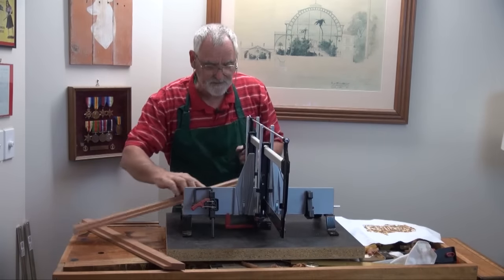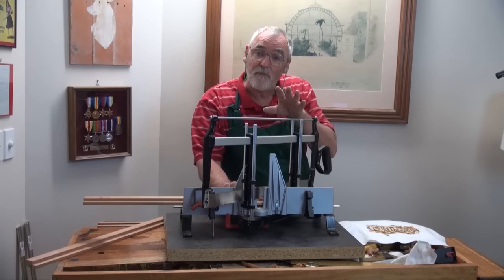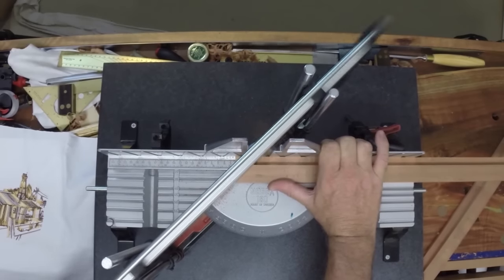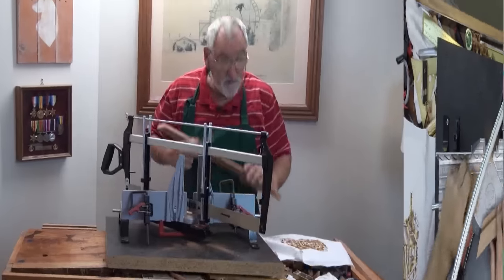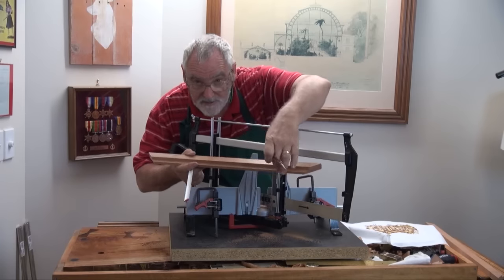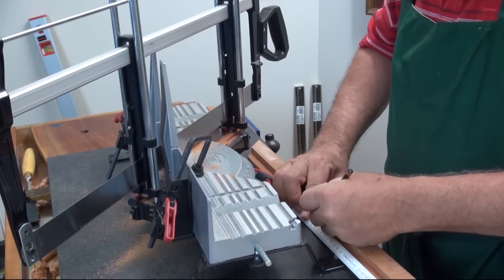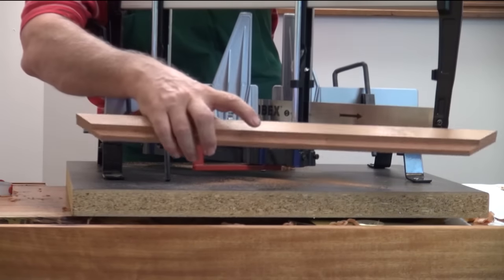Remember to keep tension on this blade. And we'll have it at 45 degrees. At the moment I'm just going to cut the ends off, and then we can measure and be more precise with the actual cutting to length. So when you're actually measuring the frame, you're measuring this inside portion here — not the step, not the outside, but the inside. So we measure back there: 250. Put a mark. So you've got a pencil mark there now of where to cut.